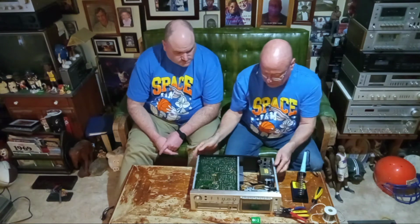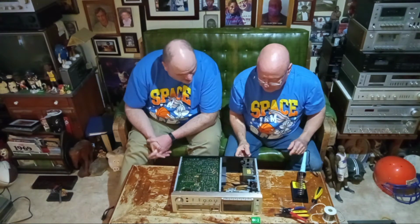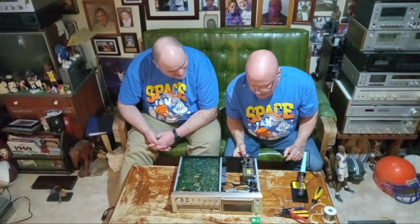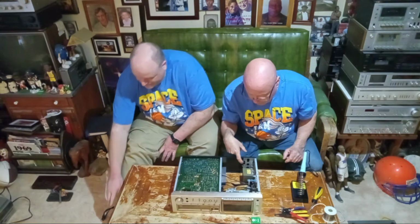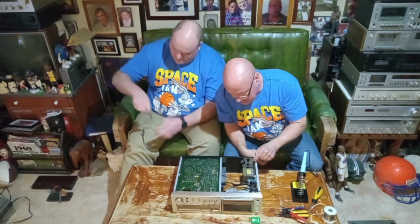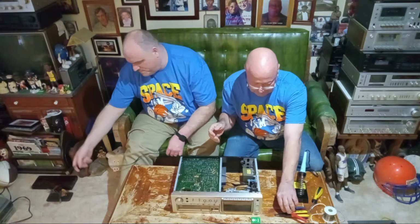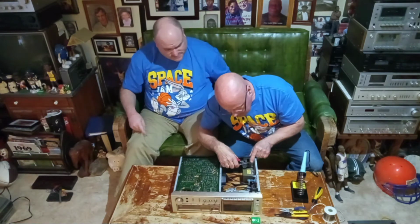Okay, so see how I mounted the fuse block in here? This is a panel mount fuse block. And we're going to take the wire from the cord, and we're going to go over to here. Not polarized either. Right, not a polarized cord. So we're going to flip.